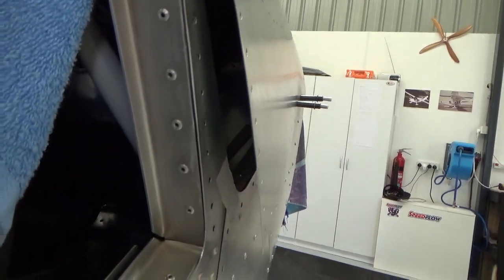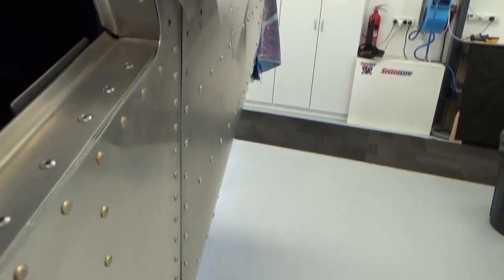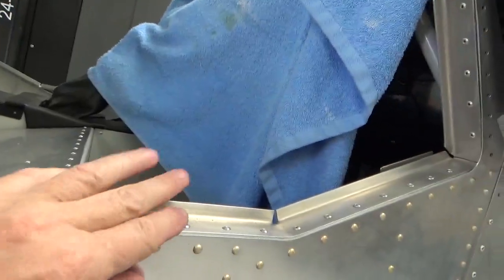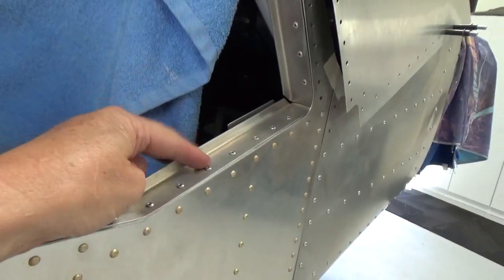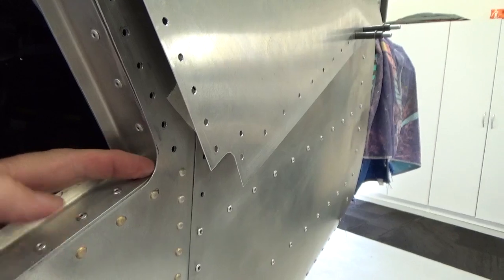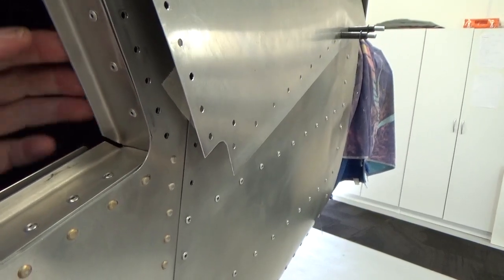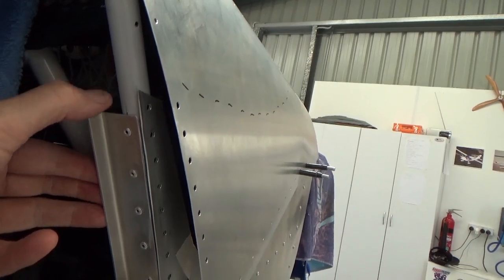So if you haven't put these on yet, get that as far outboard as practical. I left it sort of inside the skin of the aircraft, so when your bum drags over it, there's a nice edge there rather than a proud edge. So as you sneak it forward, get this piece flush, slightly proud on the outside. If you do that, the aircraft skin with the radius here is obviously stopping this, so it's tucked in hard against the aircraft skin. So I haven't really got the answer there. Just live with a little dog leg, so the seal will run down and move out by about 3mm.